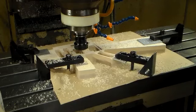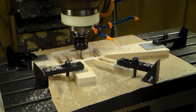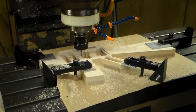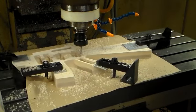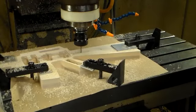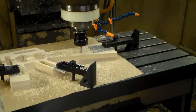I'm going to use a smaller tool to do some detail work so that the humbucker will fit correctly, and do the route back to the output jack which I will make a strip for and fill in later.